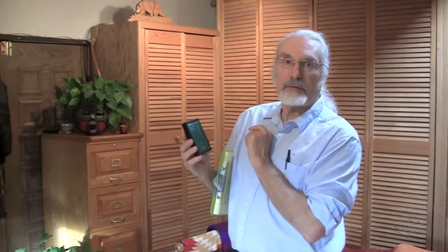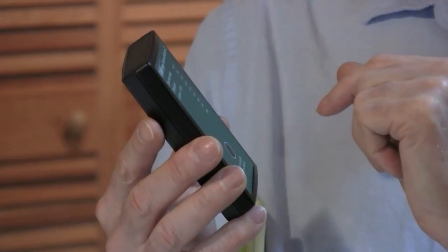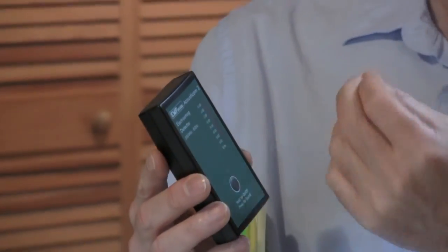Part 4: tips for better accuracy and using a data form. When you're taking measurements with the Acousticom, you're looking at the LED that lights up and the number across from it. With the Acousticom, you're getting an approximate level of the range of radio frequency strength you're in. For instance, at the top of the level you might have 6 volts per meter, and a little lower range is 3 volts per meter. But the Acousticom will not tell you whether it's 3 volts per meter or 3.5 volts per meter — it doesn't have a numerical exact display to do that kind of more exact measurement.